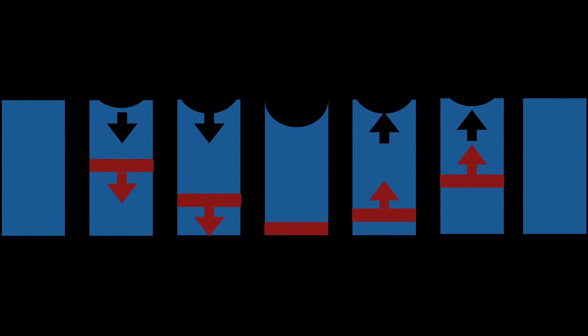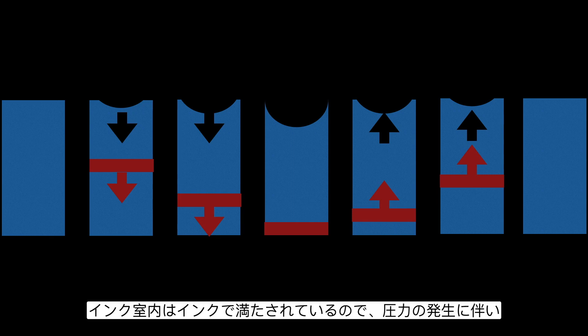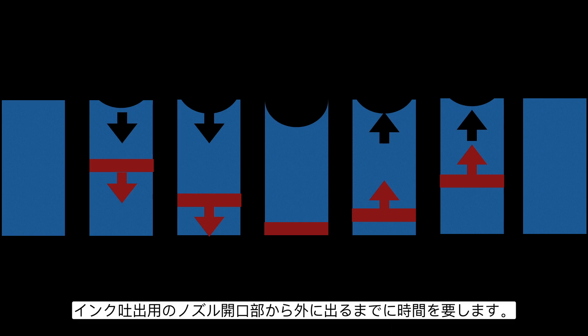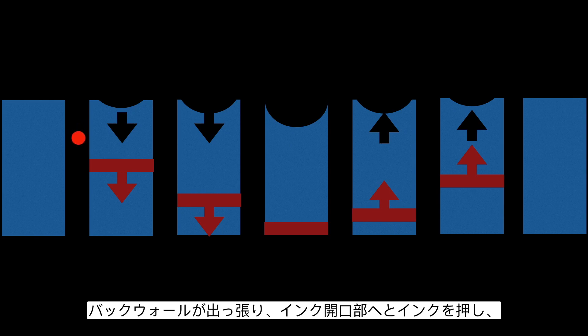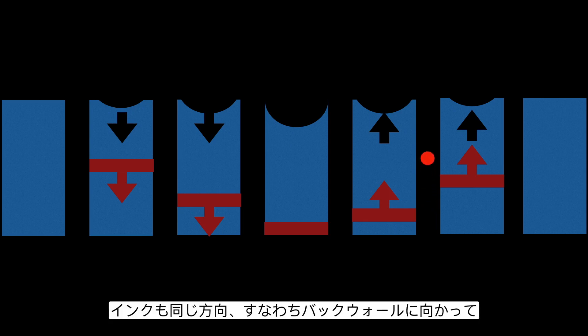Here's what's happening to the ink: when the wall moves, it creates pressure on the space inside the nozzle, and when it retracts, a negative pressure. It takes time for the pressure wave to pass through the ink and out the nozzle where it jets. With a properly optimized waveform, the pressure from the nozzle and the movement of the ink are always in the same direction. As the nozzle wall closes, the ink is moving away; as the wall returns, the ink bounces off the opposite wall and moves backward — so pressures and motion always line up.